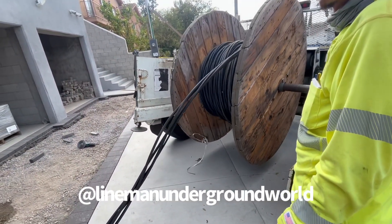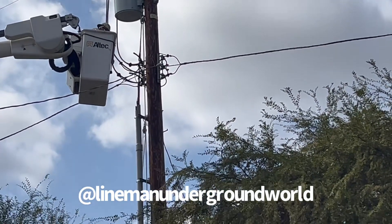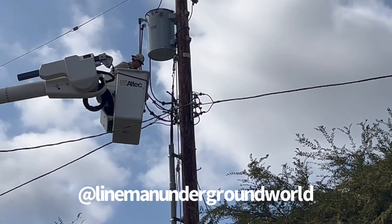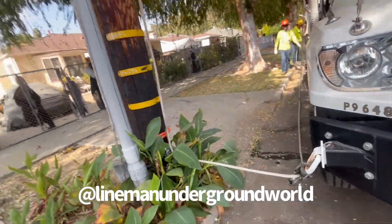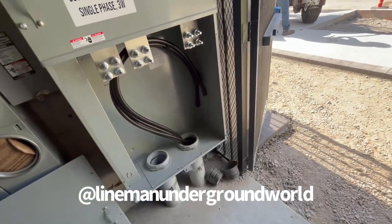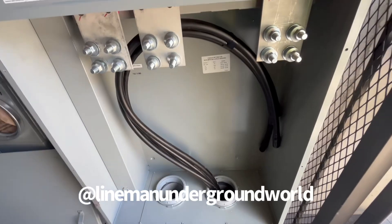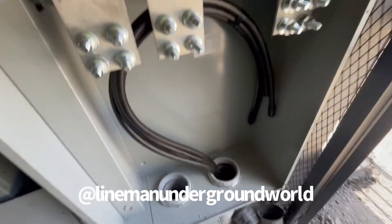As you're on the job you learn a lot of different equipment and how to operate it. He's got cable coming out now — this was a real tight pull because of the four 90s we had. He's going to slip it once or twice — had all the rigging set up, slipped it up once, and now it's good. We just capped them and they're going to energize it over there. Sometimes we usually land them but in this case the meter setters and such haven't come yet, so they'll land them when they're ready — it's safer for them. That's it for us.